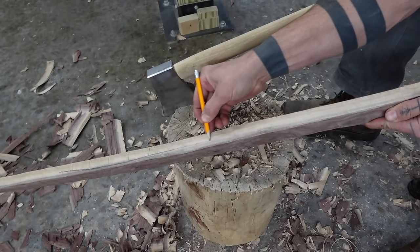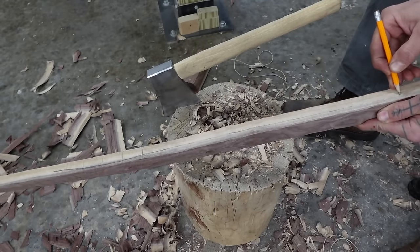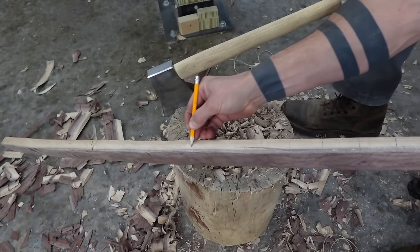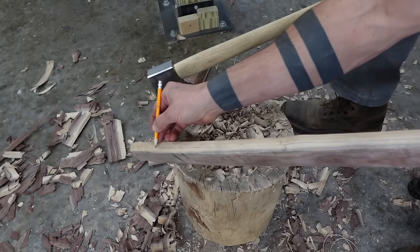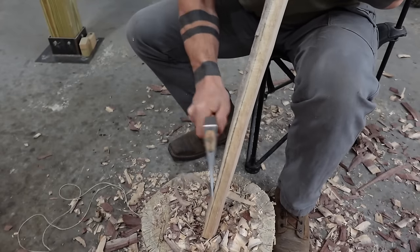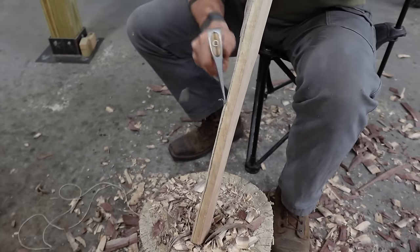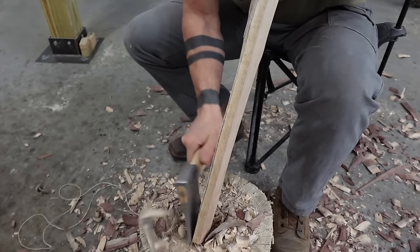For the next stage in thickness reduction, I'm gonna take the limbs down to 1/2 inch or so in uniform thickness, and that should give it some initial bend. And I'm just resting my fingers along the back of the bow to make a depth gauge. Now is the point of the build when you need to start taking extra care and extra time not to undercut your lines.